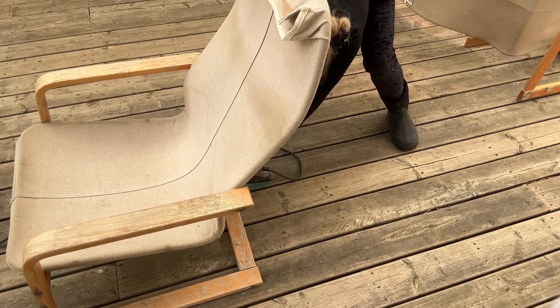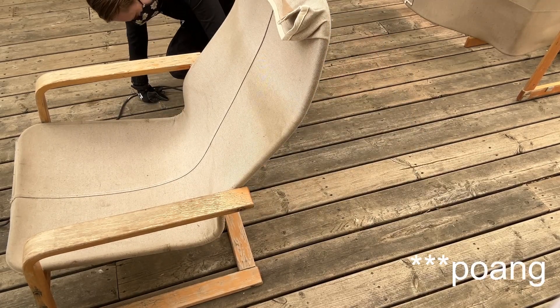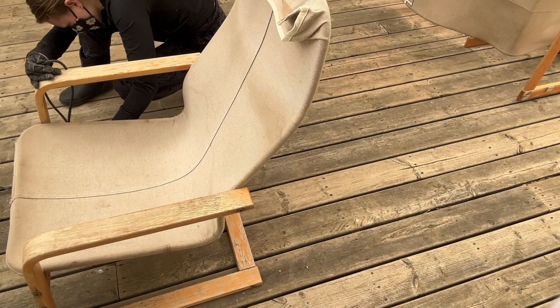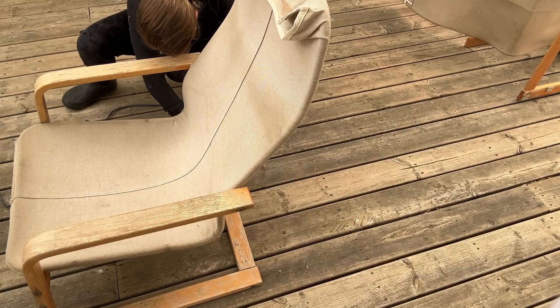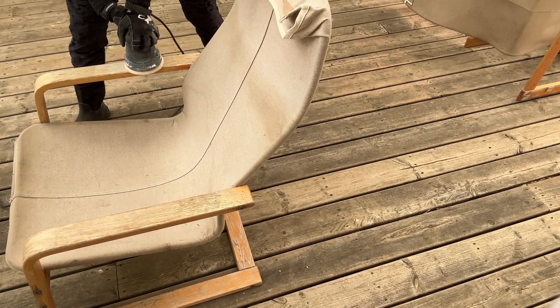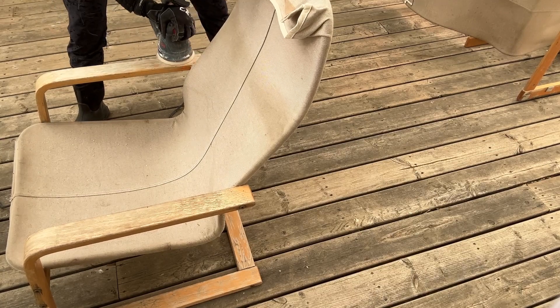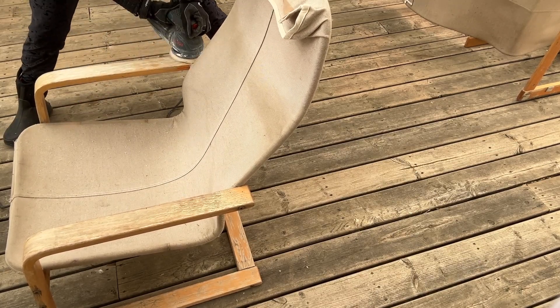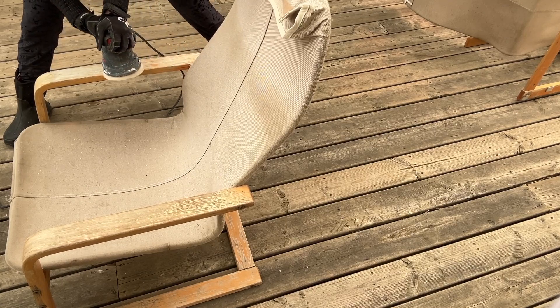These pillow chairs are compressed wood, I believe. The pillows, I believe, are more solid birch. I found that taking off the layer didn't damage the integrity of the chair. With some tightening, the screws were just fine and there's not much squeaking going on, which is good. I definitely had to stop and go purchase some more sandpaper because the 220 grit was not getting the job done.